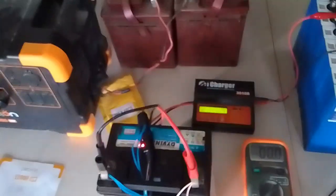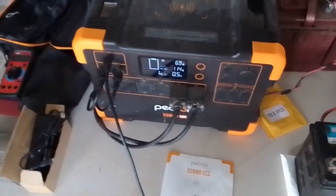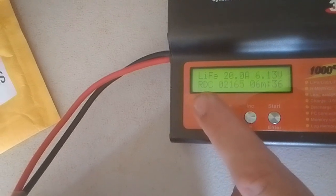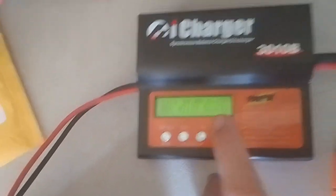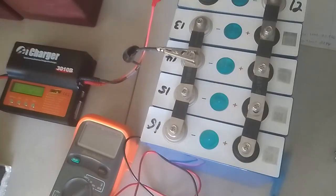And that should work. So the lead acids are just normal in the system — I'm not feeding them power directly like before. Instead I'm going through the front because realistically I'm never going to pull more than 100 watts this way because of the voltage, even though this is a thousand-watt charger, max is at 30 amps. So the discharger is currently doing regenerative discharge. I'm pulling 20 amps and we're at 6.14 volts.